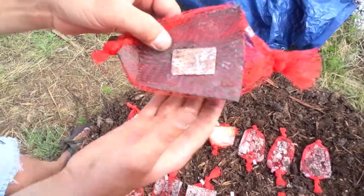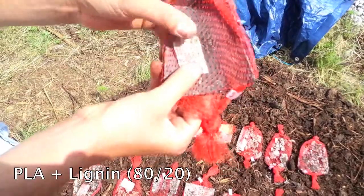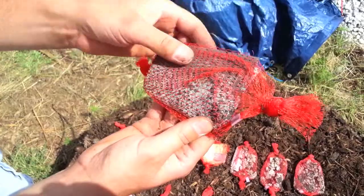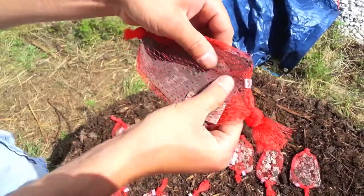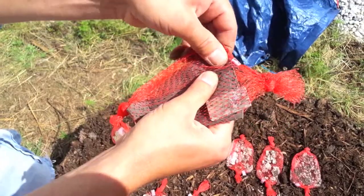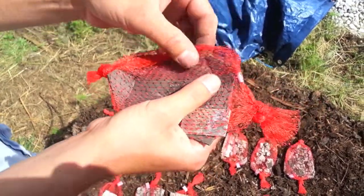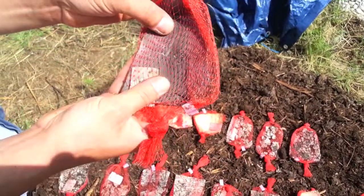This is PLA lignin, and this is kind of surprising. It's warped a little bit, so you can tell the heat has worked on it some. There is some microbial growth on the surface, but overall it's a lot more intact than we were thinking it was going to be. The piece does just snap, so it is brittle, but it hasn't broken down into the granular pieces like the soy PLA mixtures.